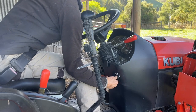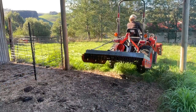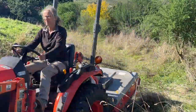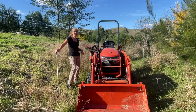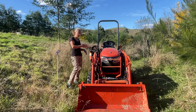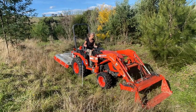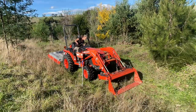Tractoring is not one of my skills but I'm going to give it a go. I should be able to with my four-way bucket just scrape the top — maybe 10 centimetres or so — off this end of the swale. I put this marker where I'm going to start to try and scrape out the top of this swale. My little bucket opens up and I should be able to just back along here and scrape as I go.